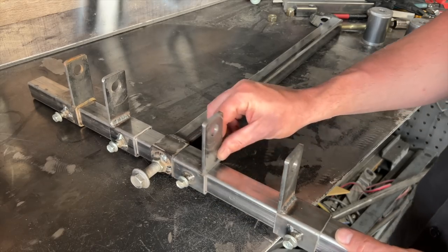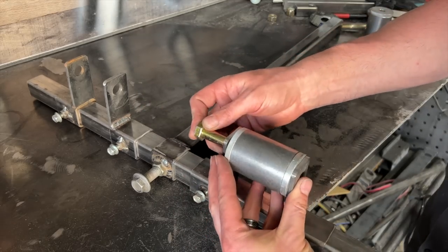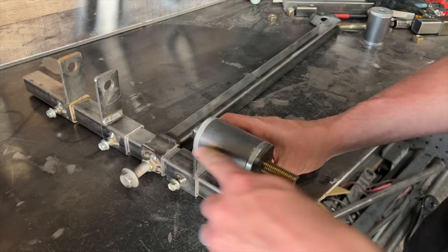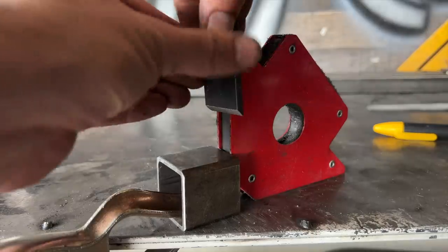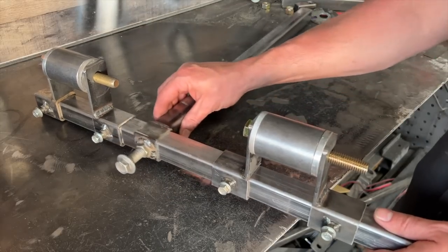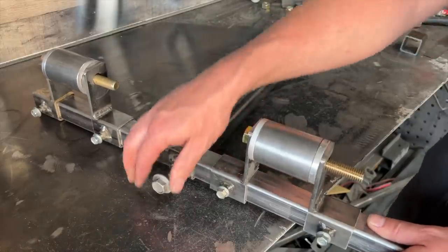The upper section of the T has four sliding bushing tabs, made specifically for the 9/16-inch bolts I use most often. This allows the machine to adapt to the width and position of the bushings. The sliding tabs also have set screws to lock them in place. Making these tabs was pretty simple: using one-and-a-half-inch flat bar, I created four pieces of identical length and drilled 9/16-inch holes through all of them. Then, using a 90-degree magnet, I welded them to the tops of the sliding sleeves. The upright of the T is also on a sliding sleeve, which allows me to change the position of the ball joint left and right between the bushings, and I can lock it down with a set screw.